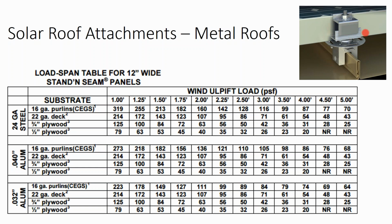I did an off-grid standing seam metal rooftop project recently where we were using all black modules. So we bought these clips and then we had to send them to a metal shop to get them black anodized so that they would match the color. It ended up looking really good, but the cost of that all in meant there wasn't really much savings on getting rid of the rail, because the amount of clips is now twice as much as what you would use on 4-foot on center. So you're buying so many clips and then you have to install all of them. And this was a 22 kilowatt array where we're putting a clip on every single seam.